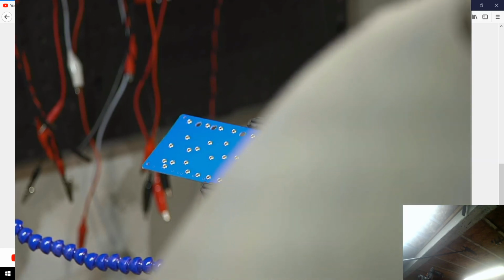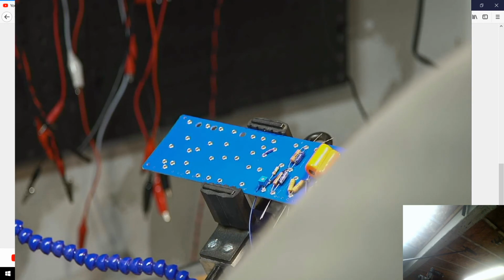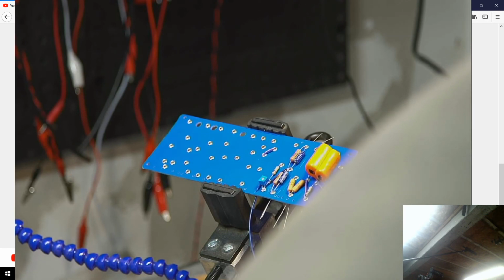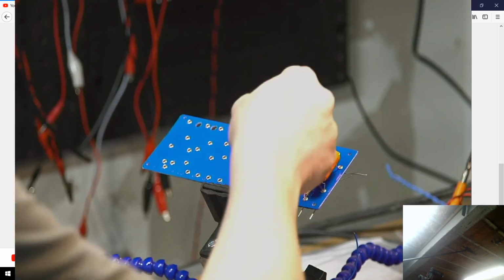Where does that come from? The second stage. Let me look at the. So you have to look at the resistors quite often. So from the second stage, I got a 0.1 cap, which I think is the overdrive. Yeah, so that goes to 100K that then heads on to the next stage. So we want that one with the black dot towards the side. So that will go here.